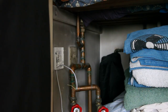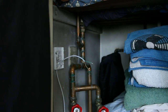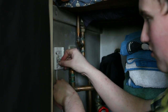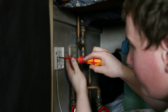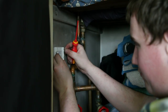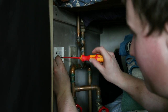Get your strippers, pop the wire in there and strip that end and strip that end. Then decide which colour goes where. I'm going to put green at the top — green on that screw — and then just tighten it down.